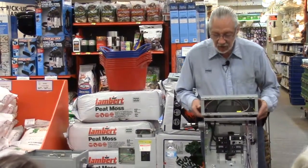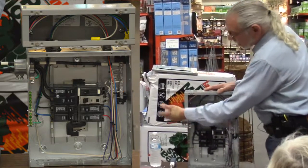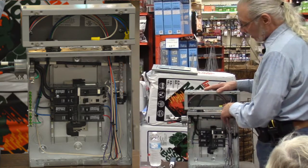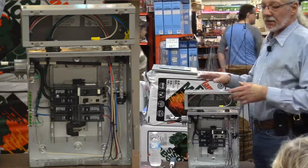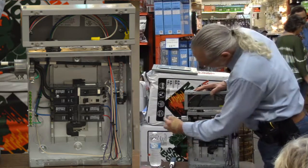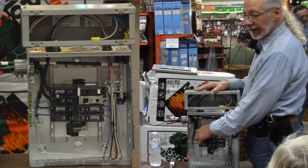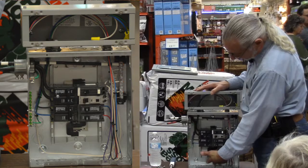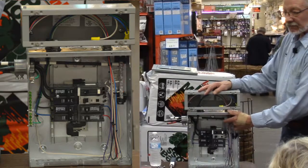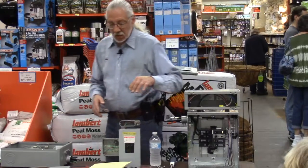You can see how the main wires are wired. Your main wires could even come into here and then down also, so that's not a problem if you had to do that. Or come in the back. It doesn't matter where they're coming in. Just be aware of how they're wired. If you've got a main breaker, the 2 hots will go to the main breaker, which is secured to the bus bar down here. And the neutral obviously goes across into the neutral bar. It's relatively simple.